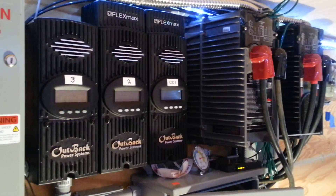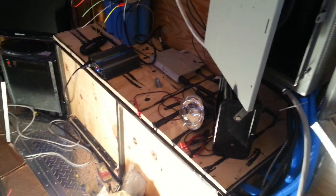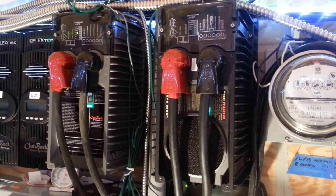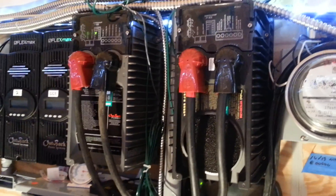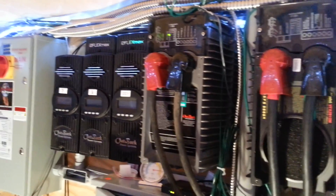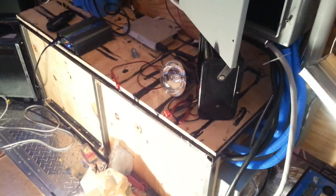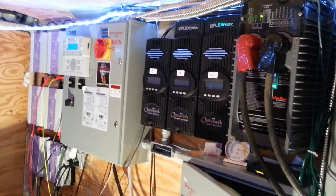So that's the RV solar setup. It's a work in progress. This is a 12-volt system right now. I'm going to keep this gray inverter, which is a grid-tie 12-volt unit, and I'm going to rewire the batteries — two are wired for 12 volts and four are wired for 24 volts. I'm going to replace the black inverter with a 24-volt grid-tie inverter and move to a 24-volt system for the high-power side. I'll use that for heavy loads — air conditioning, heating, toaster oven, blenders — things that draw a lot of power, to keep the surge off the other inverter, which I use for critical electronics. This trailer is being set up as a ham radio disaster relief trailer for emergency communications, so it'll be great to have redundant solar power on the go to set up a link station if grid power goes down.